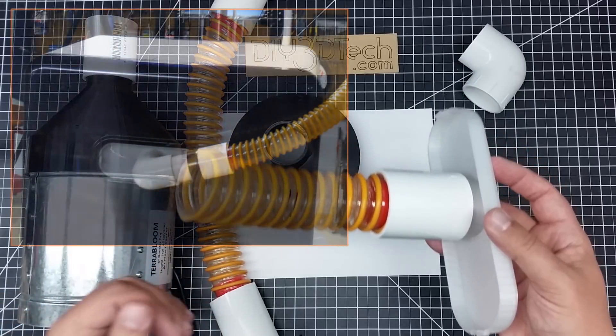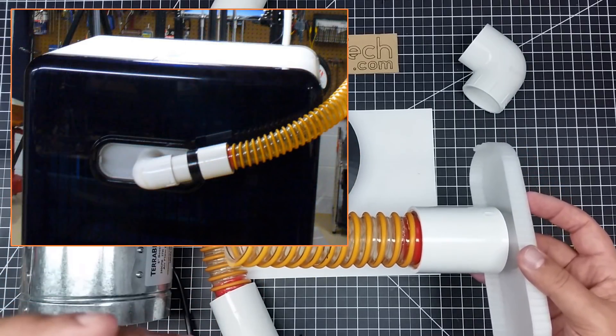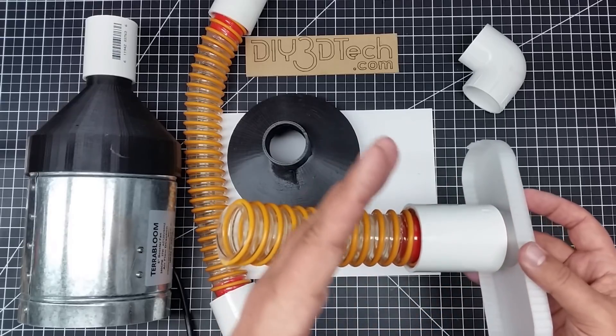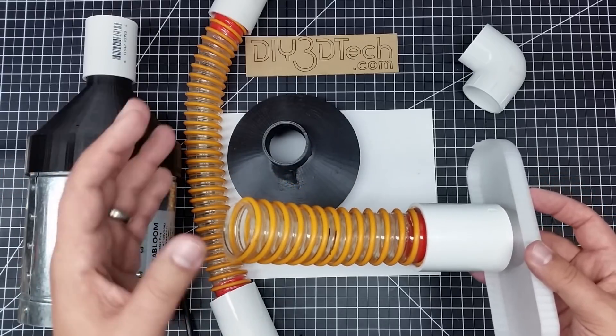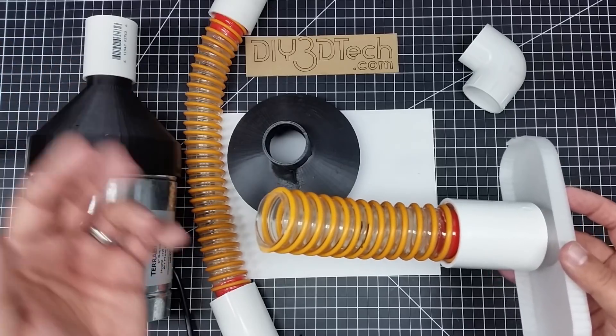I'll put some overlays up in the corner. Almost two years ago I put in a ventilation system in my shop. I used one-and-a-half inch PVC, because you're not wanting to move huge amounts of air — just steady amounts to keep fresh air moving and push the fumes from inside out. I've found the inch-and-a-half system is affordable and effective as far as installation size goes, and that's why I'm sharing it.